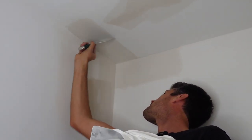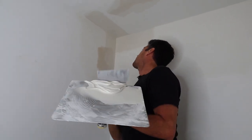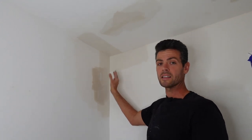I just want one more right there. Another thing to keep in mind is you can always get it really close, sand it out, and touch it up after if there is anything — like after priming. Looking up close, you can see if you get insanely close it's not a million percent perfect, but a lot of that will sand out and it'll also fill in with paint, so you're really not going to see that stuff. If there are any imperfections, you can always fix them after primer.